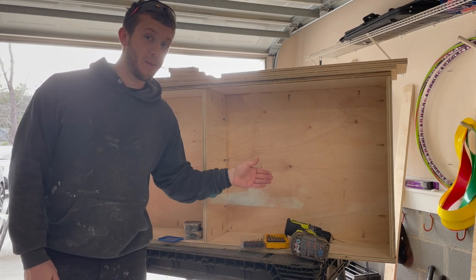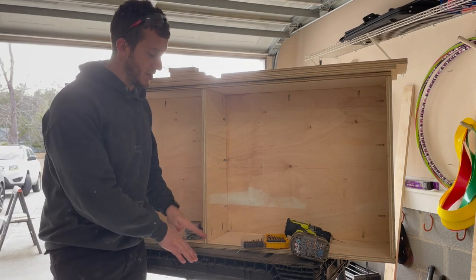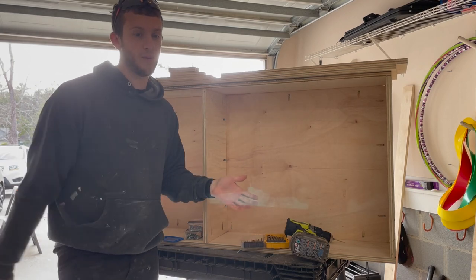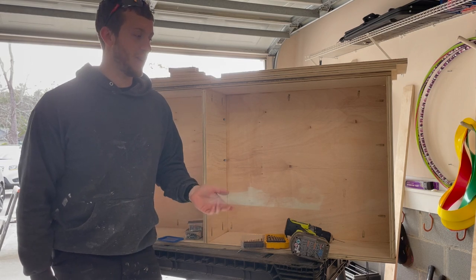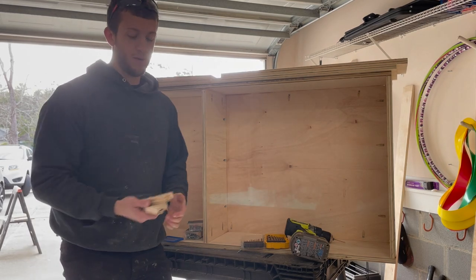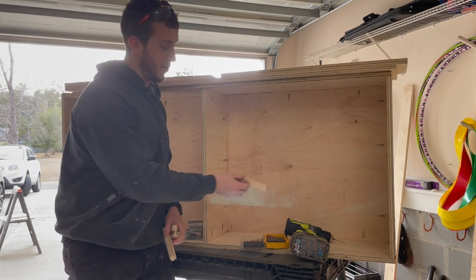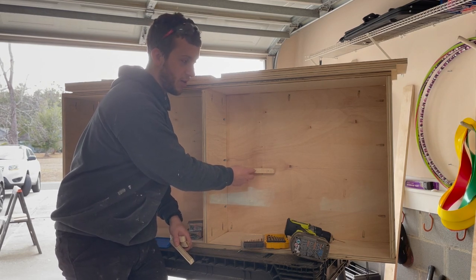What we're doing now is building one shelf inside. This shelf is actually going to be below our mattress — the mattress sits up to about here. We want the shelf to be removable so we can put clothes in, take the shelf out, and put it back in pretty easily. A removable shelf just needs the front end supported and something in the back to support it. We used some pieces of scrap wood left over from other cuts, drilled a couple of holes, and secured it so it slides right over and sits on the front.